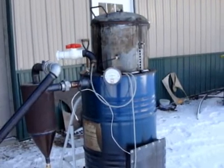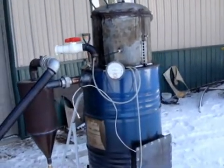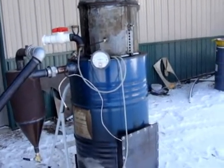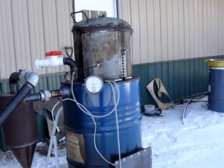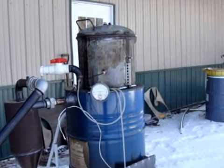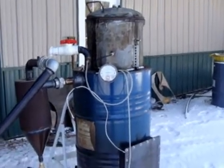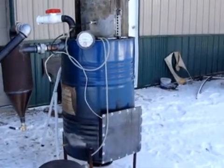There's a ball valve up on top which I use to regulate air pressure, and I'm using an old vacuum cleaner with the hose turned around backwards so I can pressurize this particular gasifier. I run it between 5 and 7 inches of water, and even with the spring-loaded lid, 7 inches is about the limit before it starts bleeding off underneath the lid. If I need to I'll just put stronger springs on to run a higher pressure.